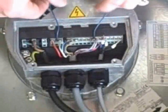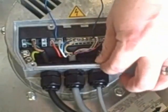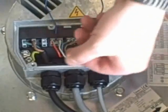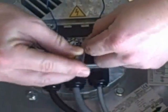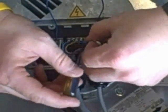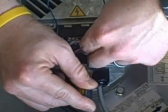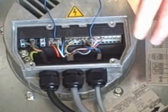Now that the potentiometer is in and tested, we're going to wire in our pressure sensor. This goes on analog two — it could be a temperature sensor or a humidity sensor, as long as it can read a 0 to 10 input signal. Again, we've got a blue, a black, and a brown, very similar to analog one, and they wire up the same way. Blue is ground, black is your 0 to 10 input, and brown is your 24-volt control. So potentiometer on analog one, pressure sensor on analog two.